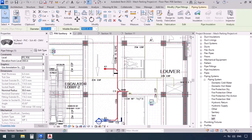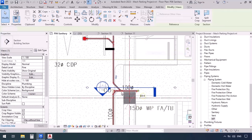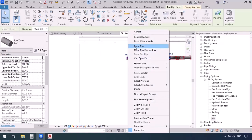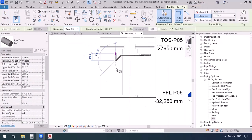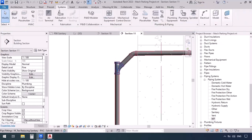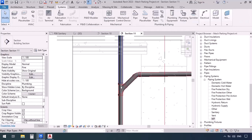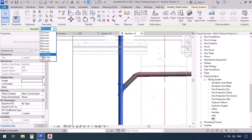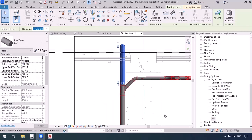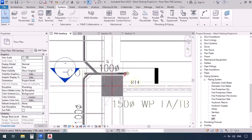For the riser, take this section and move it up here, then flip it to see from upside down, right-click and go to view. Expand the section from below. Right-click and draw pipe, then at a 45-degree angle, click, drag it down, click and escape. Select the elbow, click plus sign to convert to a T, right-click on the T and draw pipe, drag upwards, click and escape. Hold Control and select the pipe, T, and the other pipe, then change their diameter to 150. Use arrow keys to move the pipe to the right closer to the beam. Check in the plan — it's at the proper position, though not necessarily completely coordinated.